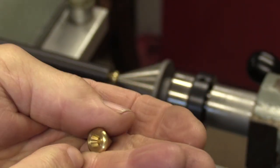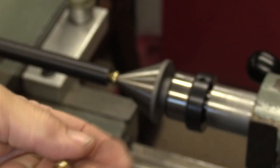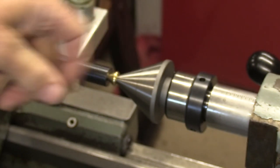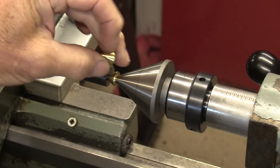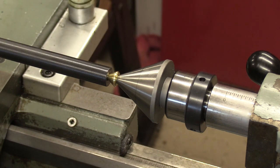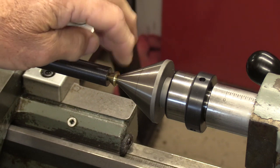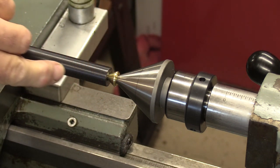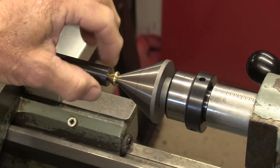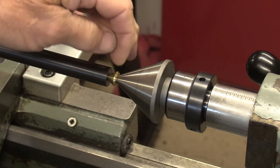This has also been drilled at a sixty degree angle so it fits center on the back side and fits concentric into the bore on the front end. What that means is we can use these brass crown savers and take a slight cut here, and then we can indicate off of the outside of the barrel and it'll be concentric to the bore.